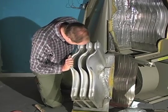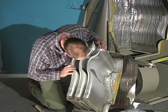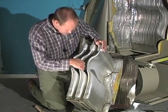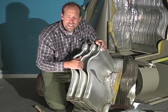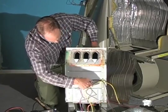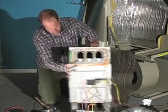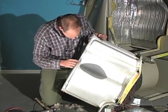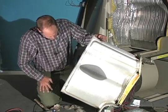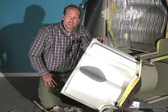And really can't see any more damage or cracks, although there might be. And in here there's a little sensor that's sensing down inside the heat exchanger — it's sensing the heat of the air — and it's probably a kill switch if it gets too hot. This is one of those sensors, and it's stuck inside the airflow of the hot air coming through the heat exchanger. This is why it was pulled out — this little crack right here failed the whole heat exchanger, and the whole heating system had to be replaced. And this is not visible during the home inspection. That's about it.